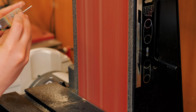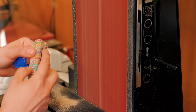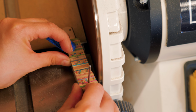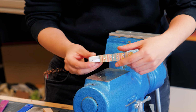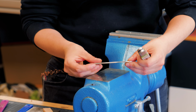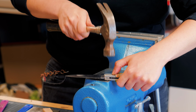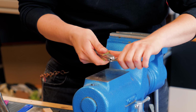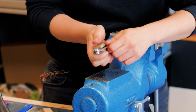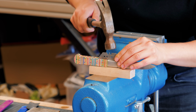I can shape the handle just enough to be flush with the liners and then install the blade. The blade was a bit stuck because I hammered the rod too hard. I released it just a hair by tapping over a razor blade between the bolster and the blade.